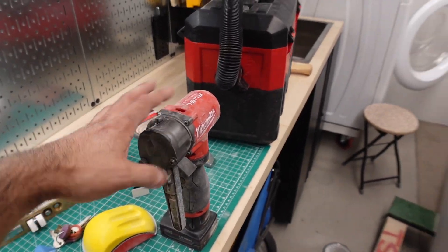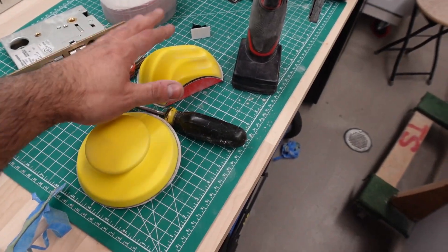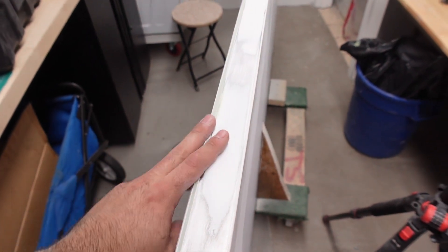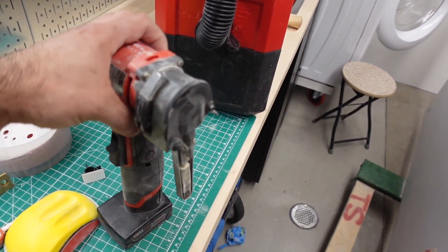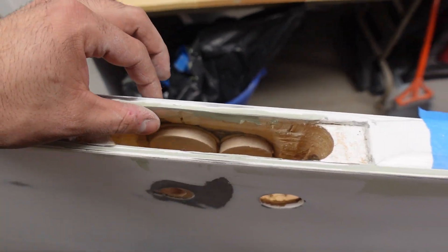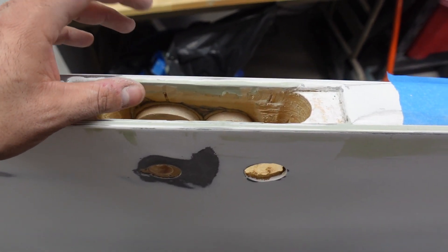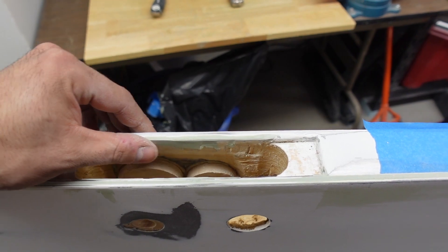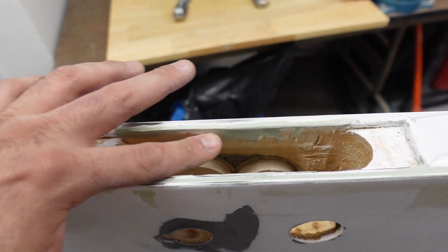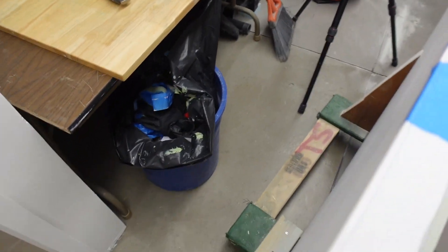This tool right here is the MVP of this whole door project. These two tools are great — I'll leave links in the description. In tight areas this has become my best friend, and that tight area is right here in this door. As you saw, we filled it up a lot, let it cure, and sanded it down to where we need it. We put a whole bunch in and took off a whole bunch to keep just that little bit — where the wood is stayed, and where the green stuff is, that's the fairing compound we filled in.